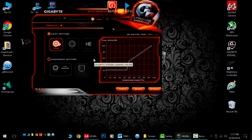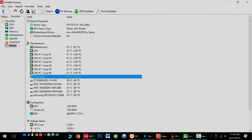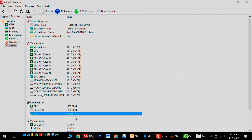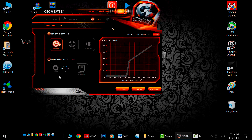On default settings the max temperature is 65 degrees Celsius. When you overclock it, it can reach up to 72 degrees Celsius. What's interesting is the 3D active fan — it should be called 3D fan stop, because it makes a threshold to completely stop the fan. No fan means it's going to be ultra silent. Your card will reach around 50 degrees Celsius, the fan speed and temperature drop, and the fan will completely stop. But don't worry, the temperatures continue to drop and there's absolutely no problem with it. It's a really cool ultra silent feature.